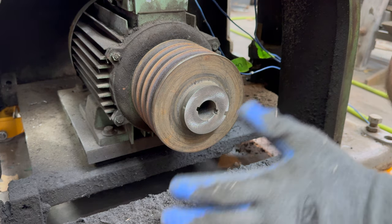Multiple disc driving clutch with brake, operated both from headstock and apron. Headstock oil tight. No gears, oil tubes, or other mechanisms in top cover plate. Apron is complete box section. All bearings are anti-friction, automatically oiled. Quick change gearbox has all shafts mounted in Timken bearings, oiled from central reservoir. Multiple integral keys are used. Ball thrust bearings on tailstock and crossfeed screws. Equipped with automatic force feed lubrication to carriage, bedways, compound rest, and apron.